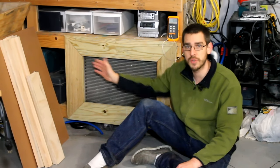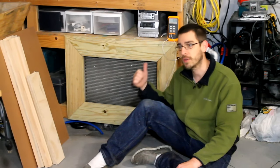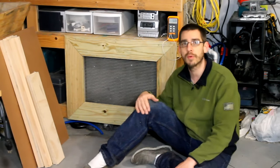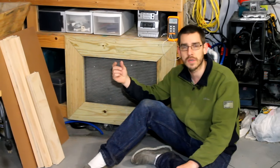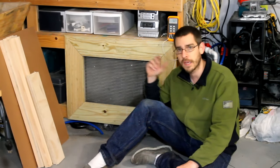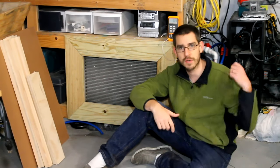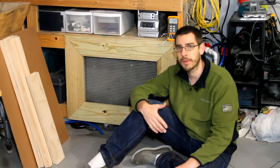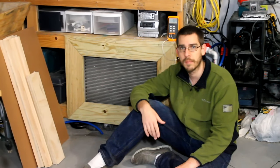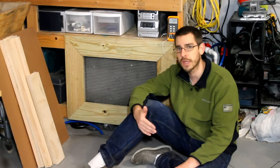You could definitely put two radiators in the system, like I talked about earlier. That's a great solution. If you wanted to really get elaborate with this, you could put in a regular circulation pump with a pressure relief valve and make the whole system enclosed, a closed loop without the sump tank here. Then you could run hotter temperatures, and you probably wouldn't hit a thermal overload on the pump that way. So there's lots of different ways you could do this, but the concept is definitely good.